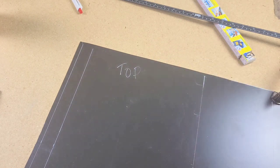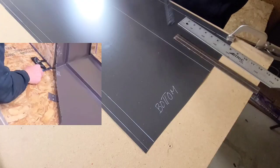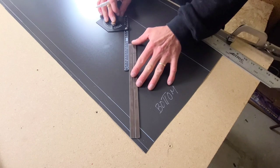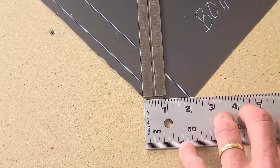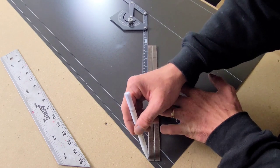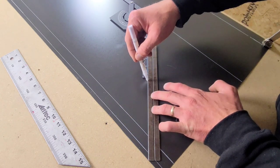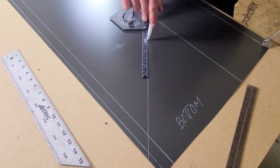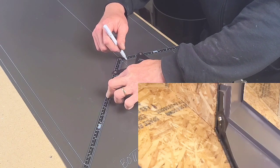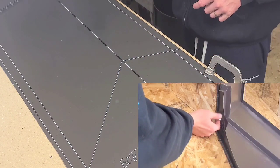Top, bottom — it's good to know the orientation when you're laying stuff out. First angle of the process: we have the roof field angle. We're going to drop this in going across. This measurement right here is very important — make sure you have at least two inches here minimum to allow for the seam later on. Drop that line in, then we can move on to the sweep slope. Guys, follow along. Do the process as I do it and you will be successful in this detail.